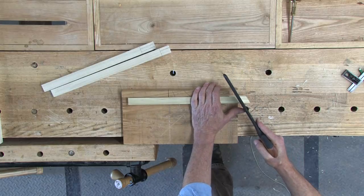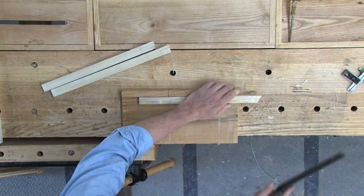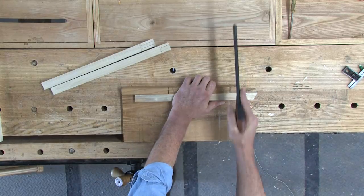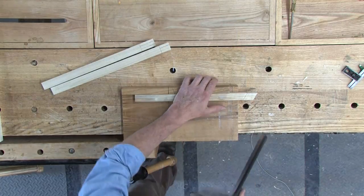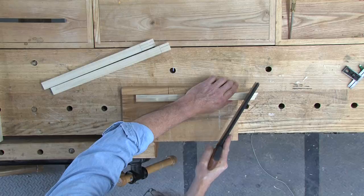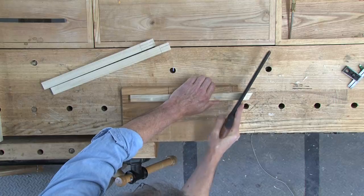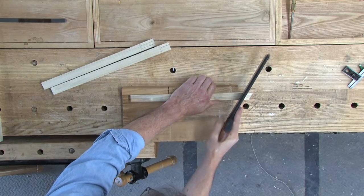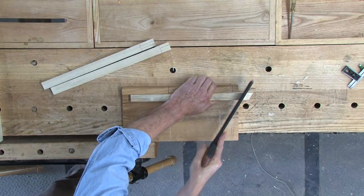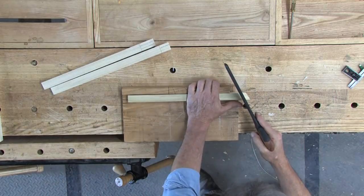One thing about sawing by hand is getting the saw started and also getting my body out of the way. So if I'm coming square, I want to be able to move my arm in a straight line. So doing the angle, I've got to get a little different stance. And if people are watching me and making me nervous, it can be hard to start. The last time I did a lot of angles, somebody offered me a miter box, and I turned it down because I don't want to be fooling with the miter box going back and forth.